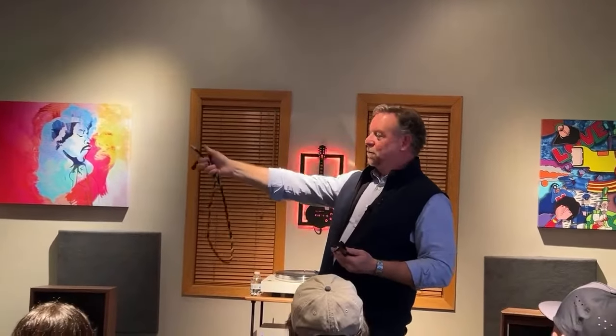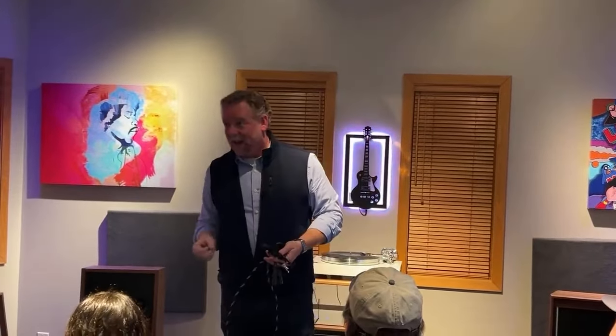If you've ever played around in studios or done any sort of live recording — you would never take a microphone and connect it to a mic preamp or console with an unbalanced cable. It's a tiny, tiny little electrical signal and we're going to send it out into the world hoping it doesn't pick up additional interference. Same with a moving coil phono cartridge — we're talking something a fraction of a millivolt. And we're going to send it to a phono preamp that will try to amplify it by about 60 decibels — about twice as much amplification as even a huge power amplifier is asked to do. So we're taking our smallest signal, providing the greatest amount of gain, and giving it the least amount of protection. It doesn't make any sense.